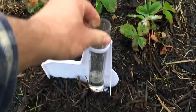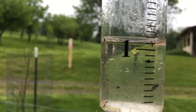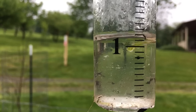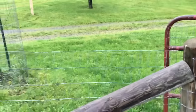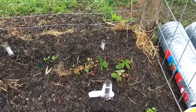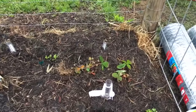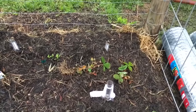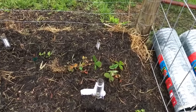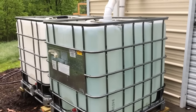Overnight we had a good bit of rain. The water gauge shows almost one and a quarter inches of rain last night. By my calculations that should have both barrels overflowing — one inch of rain gives 675 gallons and I have 600 gallons capacity right now with just two totes hooked up. So as predicted, I have one tank full and one not quite, and I'll have to look into that.